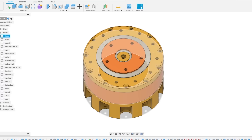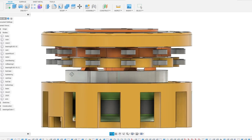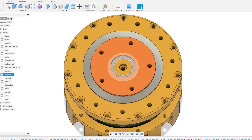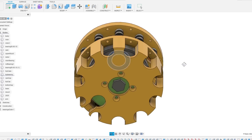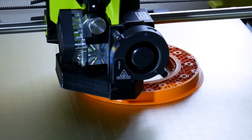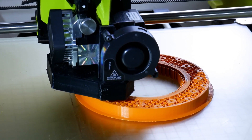The plan for version 2 is to have two cycloidal discs which are 180 degrees out of phase so that all together they spin on center. I used bearings before to make this run really smooth and I'm going to do that again. We're also going to brace the end of the camshaft in the end of the motor, so we have a bearing at the top and the motor bearing at the bottom. I'm intending this to be open source and 3D printable, with all parts accessible such as bearings, nuts and bolts.